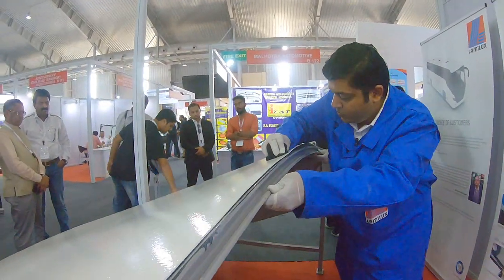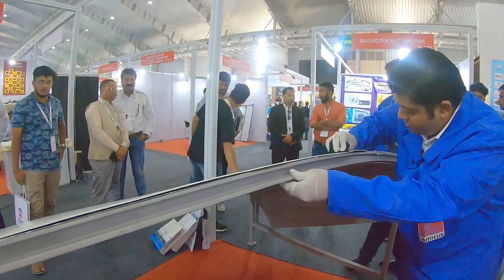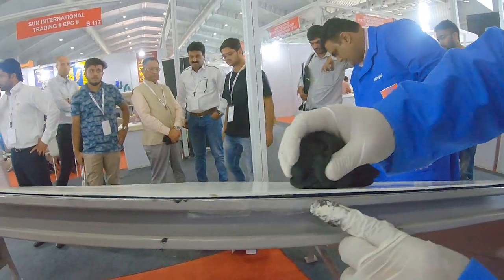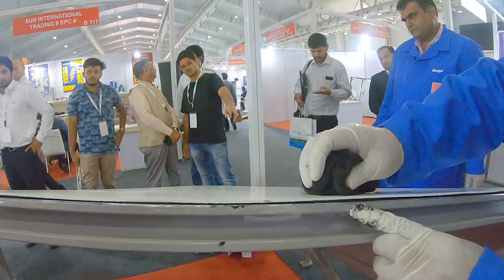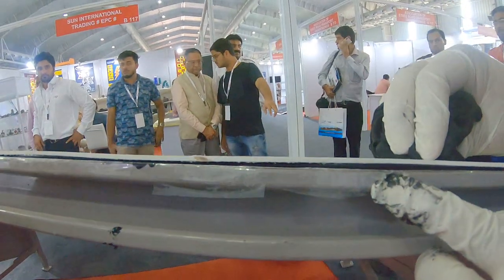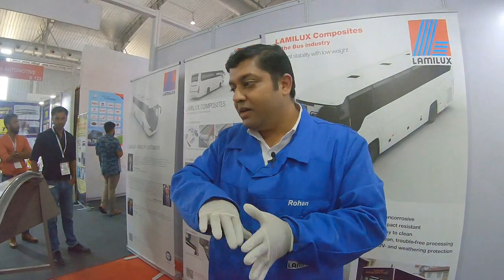We use cotton waste material or a linen cloth and press it uniformly. It is very important that the adhesive comes out a bit, which acts as a barrier for water resistance. The other method is the use of metal rollers — you can roll them all across the roof for uniform pressure, which makes for a stable roof.